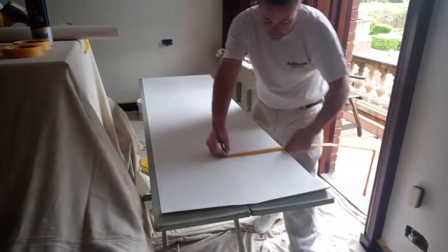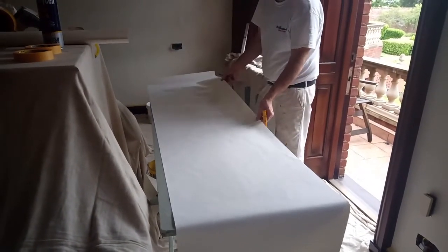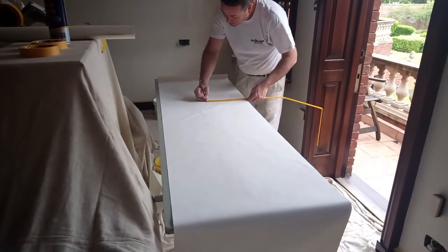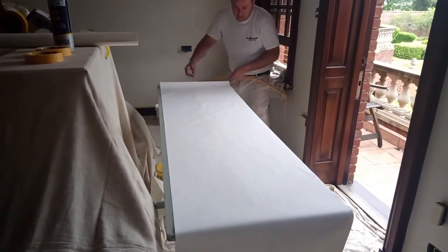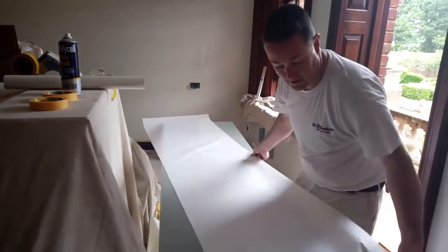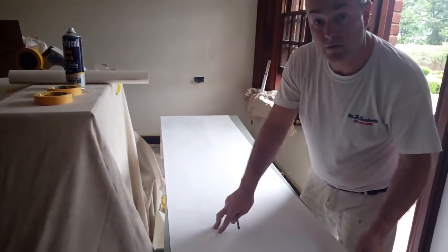I'm going all the way down, shuffle it up, line it up again, match back up to where your pencil was before - just over 10 inches, about 255mm - and I'm going all the way down again. Now this is the piece I'm going to cut off. Here's my two halves: the left hand side goes into the angle, the right hand side goes out of the angle.